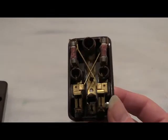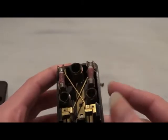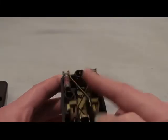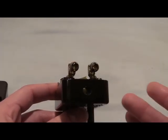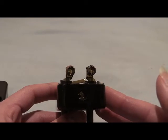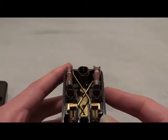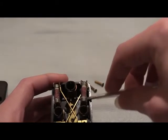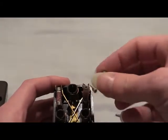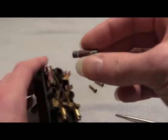The idea was that if there was a fault or overload, both fuses would blow and protect the circuit. But what would sometimes happen is the live fuse would stay active while the neutral one blew. If you had an appliance connected and it wasn't working, you'd assume it wasn't live, touch it, and get an electric shock. That was the problem with double pole fusing, which is why in modern standards we don't put a fuse in the neutral.